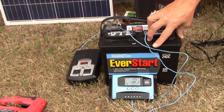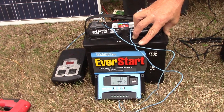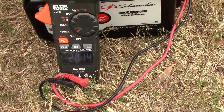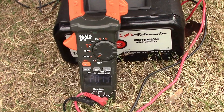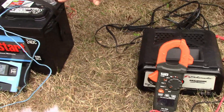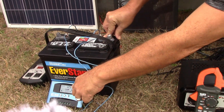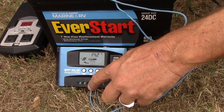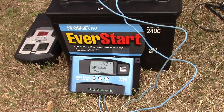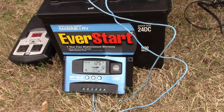This is my main charge controller I'll be using when I connect my solar setup. This one is a 100-amp charger — 12 times 100, that's a 1,200-watt charger. Right now I'm checking the voltage coming directly out of the panel; it is currently putting out 20.16 volts. 20 volts is too much to charge a 12-volt battery — you can't do that — so you have to use a charge controller. The charge controller is monitoring my battery voltage at 12.5V, and the charge output reads 14.2 volts. So it will take my panel at slightly over 20 volts and reduce that down to 14 volts so I'm not overcharging the battery.